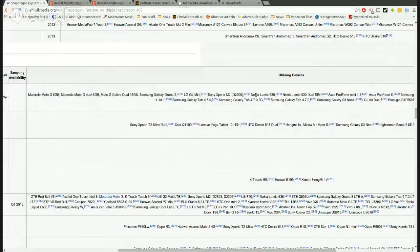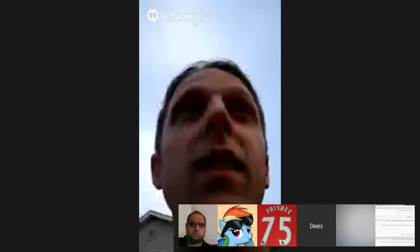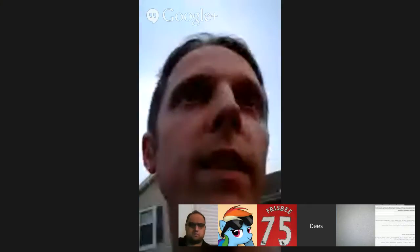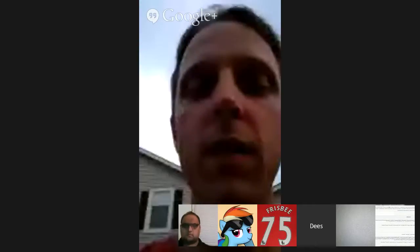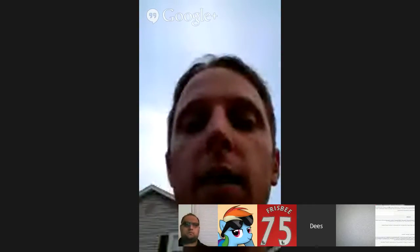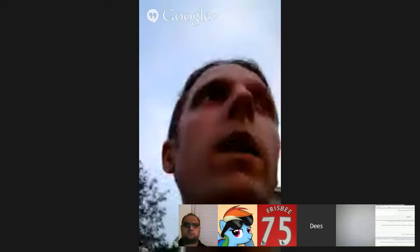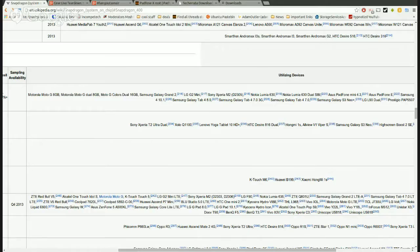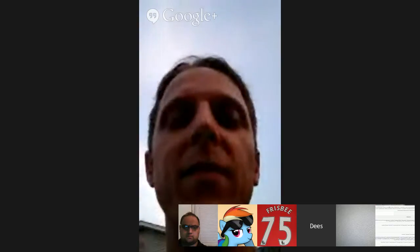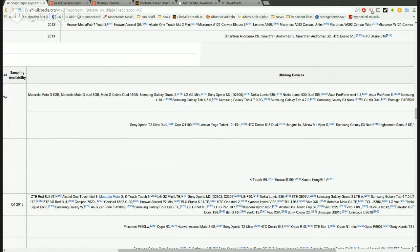Okay, so does that mean that we're not going to be able to get this thing to boot at all? Possibly. I can try sometime maybe repacking the Moto G build without a DTB. Sometimes the bootloader will extract a DTB from the device and append it on its own when you're using fastboot mode, but I'm not 100% sure if that'll work. I can try unpacking this kernel and then repacking it without a DTB. Open recovery. Right.